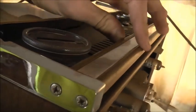Get it all apart and clean it. Give them an ESR meter check, because even though that thing did work quite well, no hum bars, nothing, it performed quite well when I tested it in the shop. So I give everything a good clean. Check the capacitors with the ESR meter. I will need replacing eventually. There you go, it's a hybrid circuit board and chassis, point to point wiring. Bit of damage there, that's just the plastic veneer coming off.